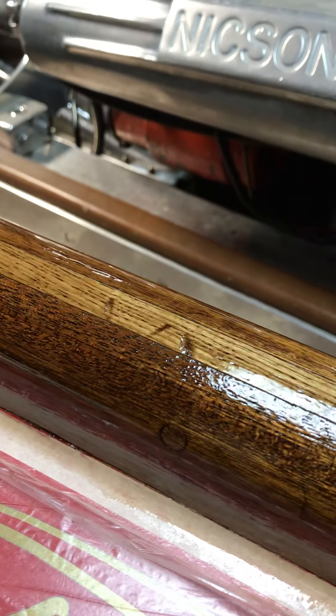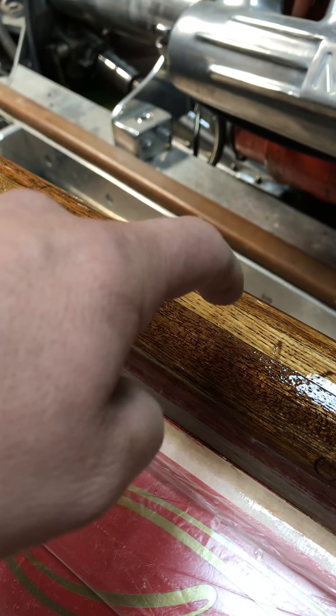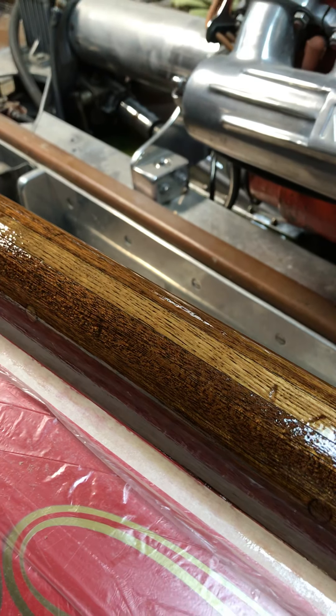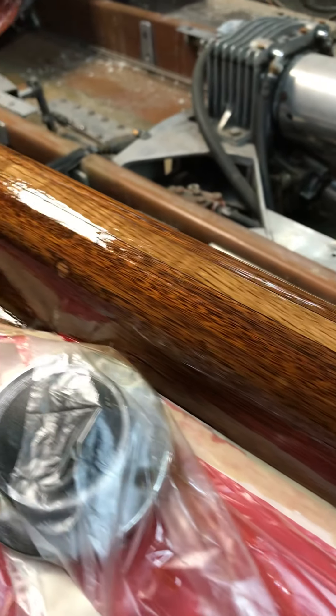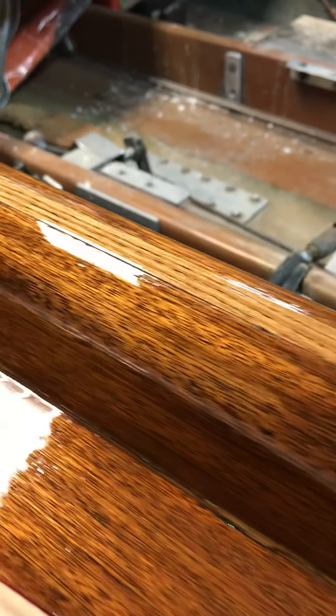That's because I actually took a hand plane to it — these were about an eighth of an inch off in height difference. The outside was maybe an eighth of an inch taller than the rest and they were kind of separated. I poured epoxy in wherever I could, but I don't want to go pulling it apart, so that's why I added all the screws — to make sure it doesn't come loose over time. I placed them every seven inches, if I remember correctly.